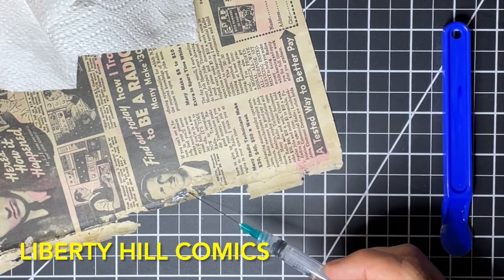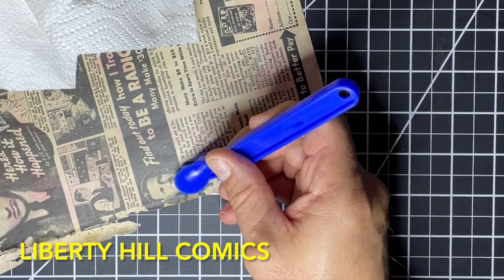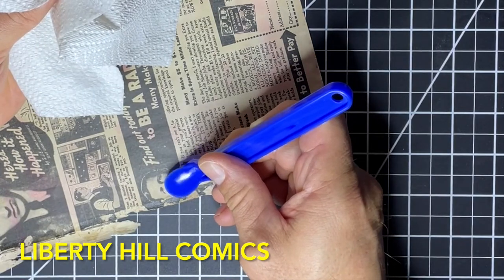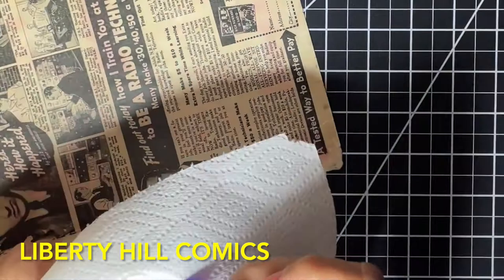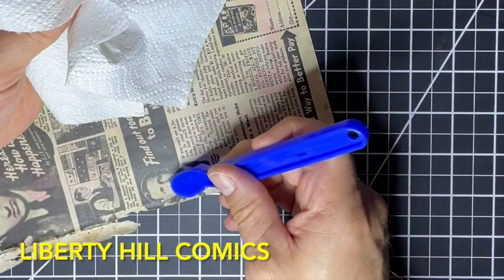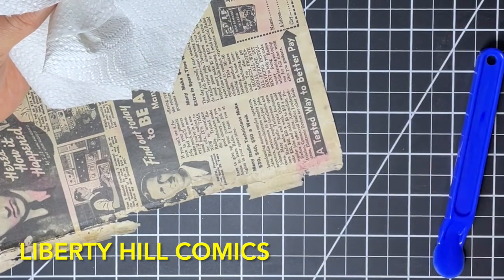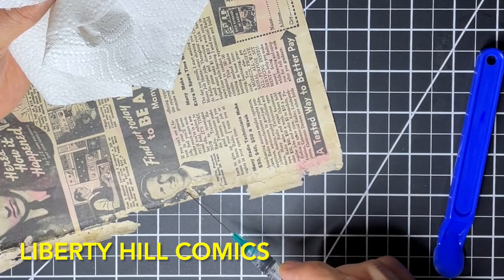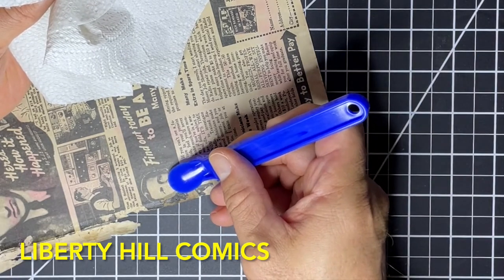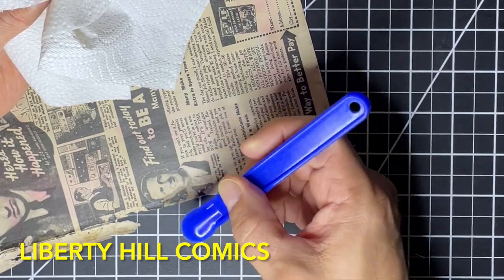Tide lines, somewhat maybe non-intuitively, once they've been deposited, they're very difficult to remove, even with the same solvent. So you would think, well, all those things are soluble in this solvent, so the same solvent that created the tide line, I'll just use that solvent and I'll remove the tide line. And I don't actually know the science behind why that doesn't work, but I can tell you in practice, empirically, that does not work very well. You will have a hard time removing a tide line, even with the exact same solvent that was used to deposit the tide line.